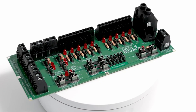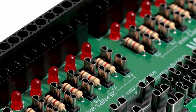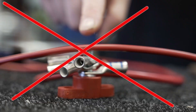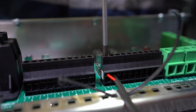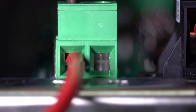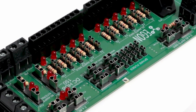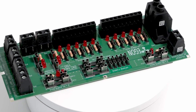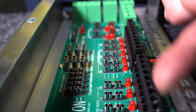The reason why that's a good idea is that because the connections are such high quality, you don't need heat shrink, you don't need to solder or crimp lugs — no longer necessary. All you need is a screwdriver and you put the cables in. These clamp them down properly, voltage drop is reduced significantly, and labor time is reduced enormously.